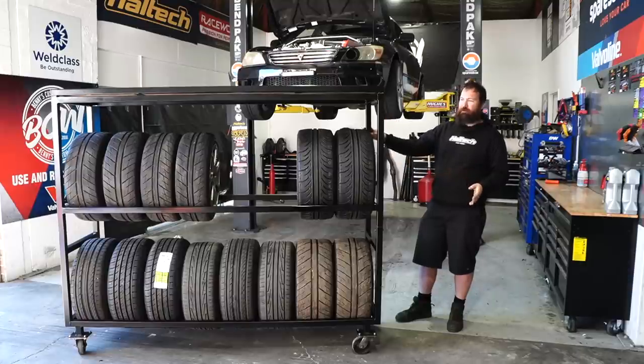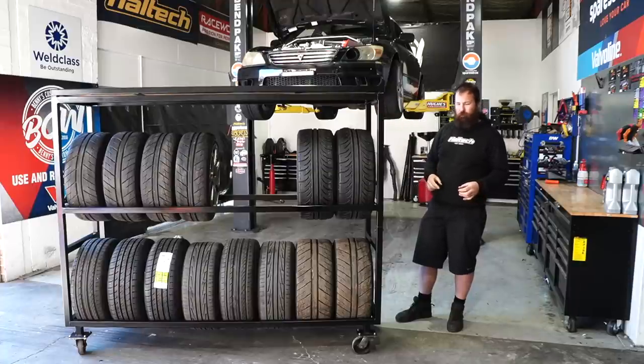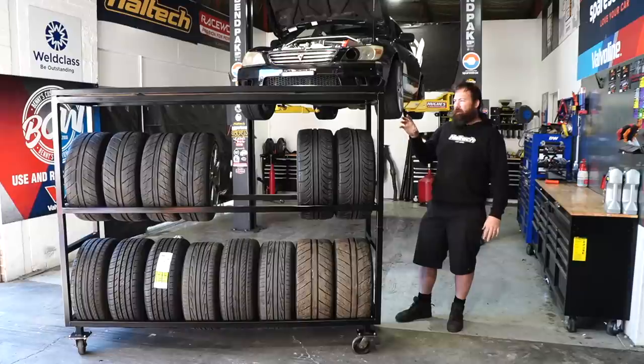Like we've probably mentioned a few times, this is 40 mil by 2 mil wall, and then all of our socket joints are 35 mil by 2 mil wall. So it's a pretty tight fit. We also showed in the video earlier about crushing the tube down. I think we videoed it but didn't actually mention it. If you crush it side by side, it pulls the tubing in a touch, which means you've got a slightly looser fit, and it's nicer to pull apart.